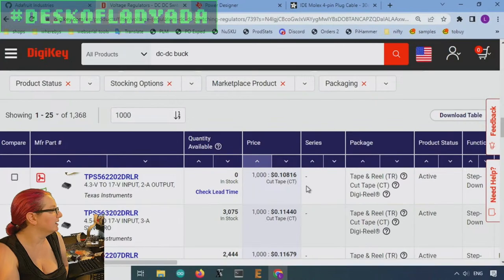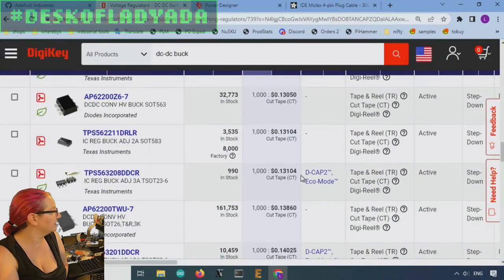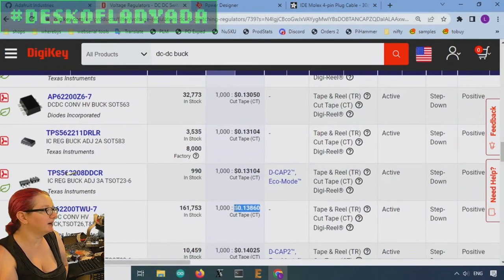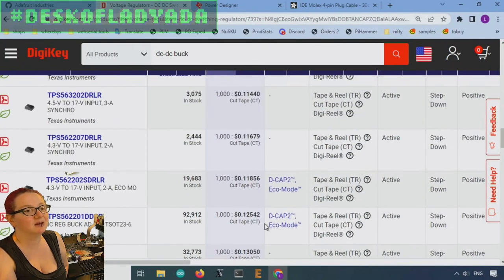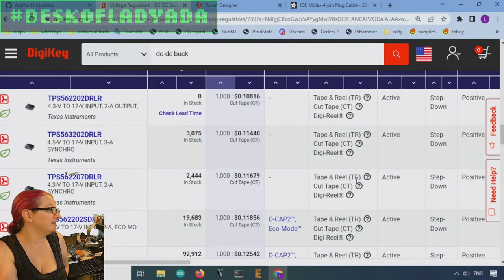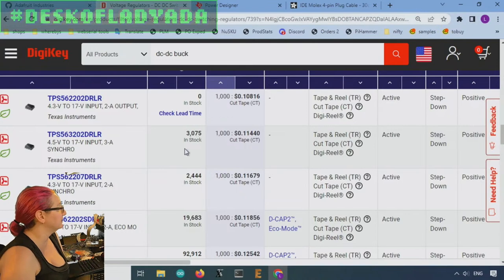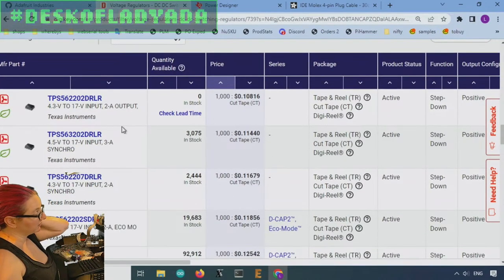You can also go to TI's Power Designer web bench. I put in VIN of 10 to 14 volts, output 5 volts, 1.5 amps, low cost, and it generated parts from the same 56-series family — TPS5622, 5623, 5624 — going up to 4 amps. The TI web bench tends to give you a slightly larger-than-necessary power budget, but you can follow it and see an entire BOM cost of about 51 cents. These are higher-frequency chips.